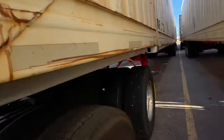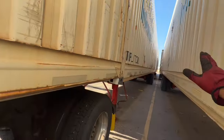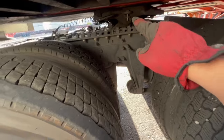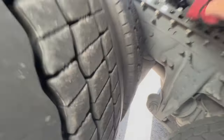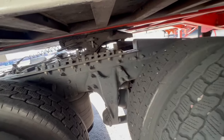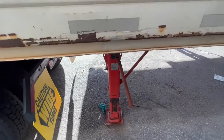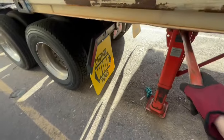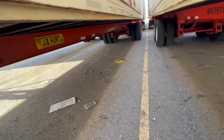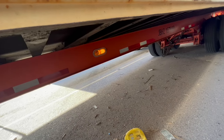You also want to check your lights and make sure those work. Since I'm walking front to back — if I'm going to pass it, I'm going to inspect it. Looking at my fifth wheel, making sure that the handle is all the way in, making sure there are no gaps between the skid plate and the chassis. We go in the back underneath the chassis and you can see the shaft around the kingpin. The very next thing to do is raise the landing gear. Underneath you'll notice there is a side reflector and turn signal — you can see that's working properly.